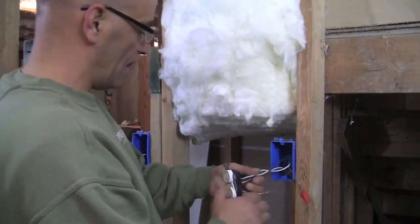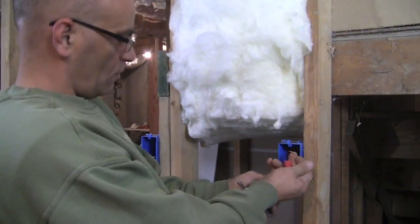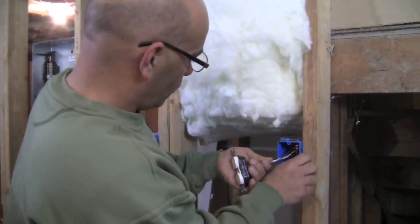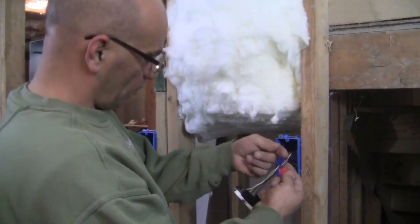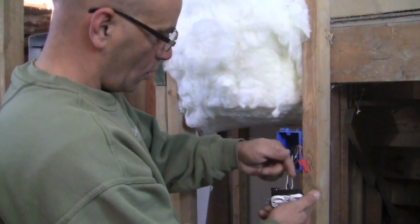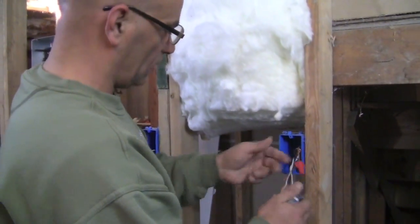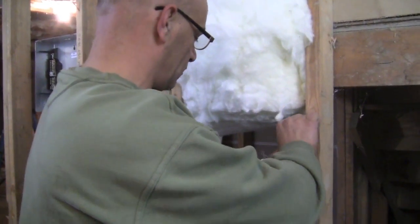Okay, so you got all that. Now let's grab the wires, and you got a lot of wires here. Now you got this big one with the wire nut on it. You want to push them in. Now again, I've already put the electrical tape on. See the ground, and it's all bare like that. Try to keep your grounds on the side where the grounds are on the outlet, just in case it was rubbed against somehow. You don't want to do that.